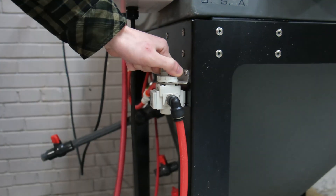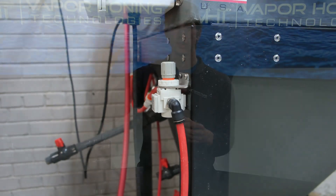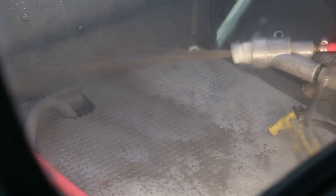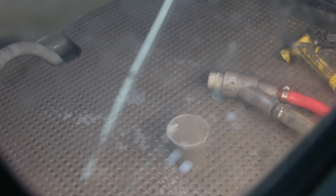The easiest way to do this is to put your hand to the machine and make certain you have no pressure on it. Turn the gauge down at the top — there should be b-roll playing so you can see exactly what's happening. Or just completely disconnect it from the air, make sure it's all bled off by stepping on the foot pedal first. Then it's going to allow the machine to agitate and pump that slurry up through the blast gun. Hold the blast gun over the cup and let it flow for a few seconds until it completely fills the cup and is spewing back out, then let off and take the cup out of the machine.